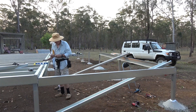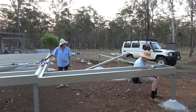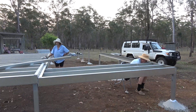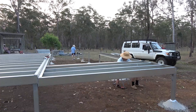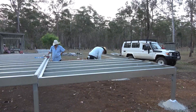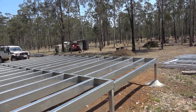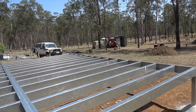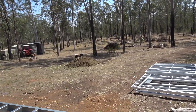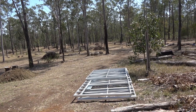This video is a time-lapse of setting up the joists on the veranda section of the house. You'll notice on the left-hand side there, the beam's about 50 millimeters lower. That's to take the timber. The veranda's got to be 50 mil lower than the main building. We're fast workers. To give you an idea of what it'll look like from the veranda, that's the view we'll get off the veranda.